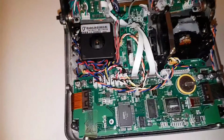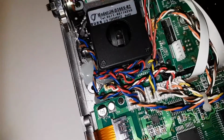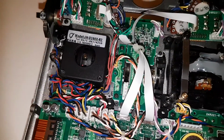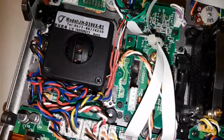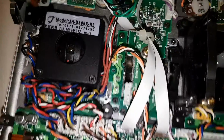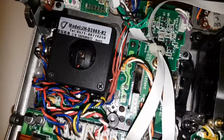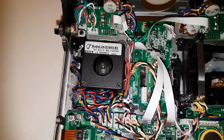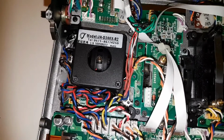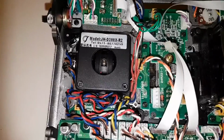So there we are. We've soldered all the wires together. We made sure they all went in the right direction. Now the centre part for the rudder, they come out, they have little wires there. So what I've done is cut the wires and solder join them and put heat shrink on. Before you actually heat shrink them, it's best to test, make sure your wires are around the right way. Otherwise you're going to have havoc.